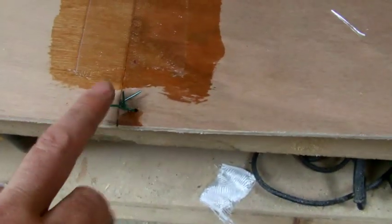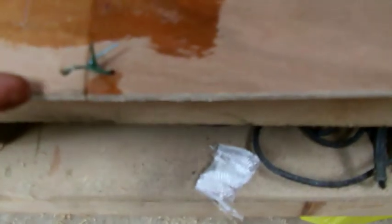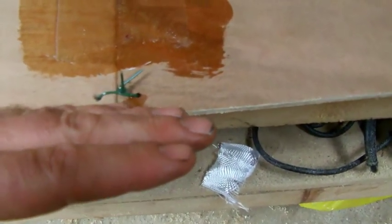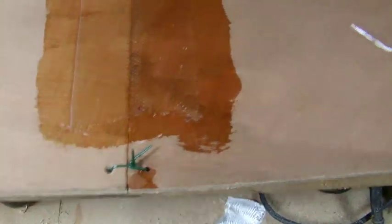On the bottom panel, one end has a piece of wire put in to pull the butt joint together. The tape doesn't go right to the very end because another panel will be added to the side. That's the first chine going on, and eventually there will be another piece of tape running along this seam, which will overlap it slightly.